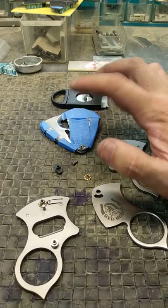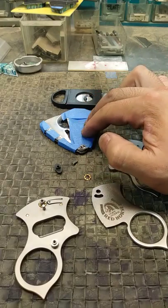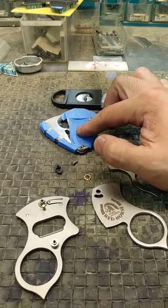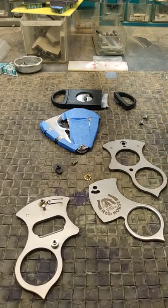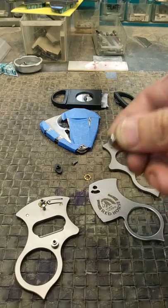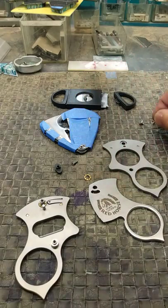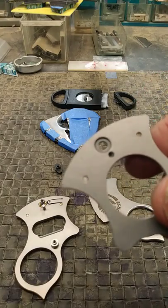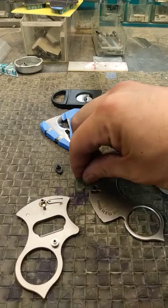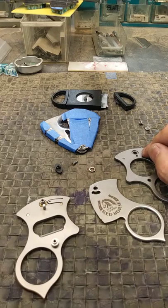That's why they need a spring in there for the action — because there's so much friction, they need the spring to force the blades out. Sure, it looks cool when you open it up like a switchblade, but in reality it's a much inferior way to do things. With the BMF cutter, you don't need that. Our screws, which don't strip out, are also 416 stainless — very high-quality stainless — and they're machined specifically for this cutter. There are hardened steel washers in the bearing pockets so the hard ceramic doesn't wear a race inside the softer titanium, which adds years to your cutter's life.